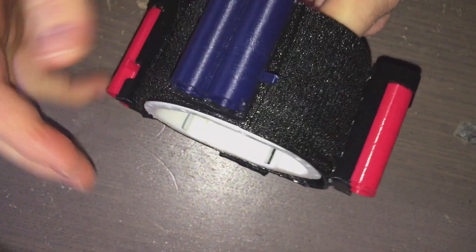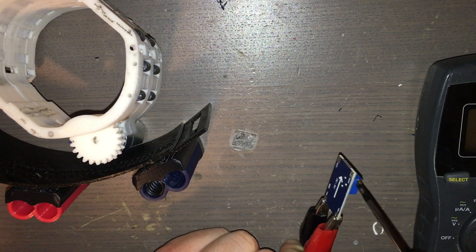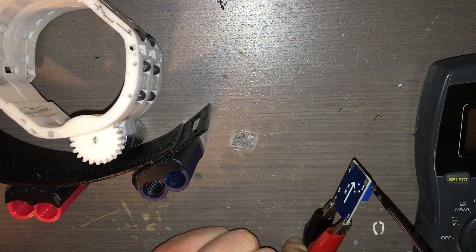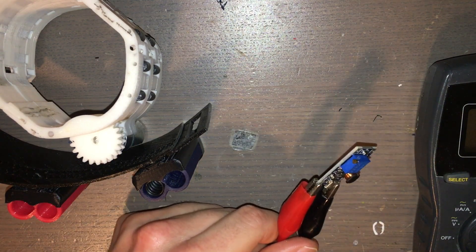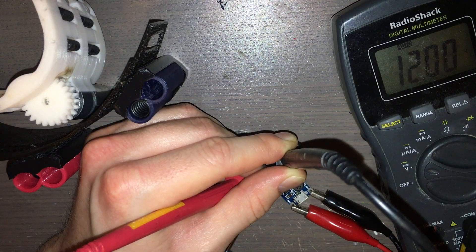I think the next step is to make a button for the palm so that I can rotate this with that button. For this project we're going to be using a voltage regulator because our power source is going to be five volts, but our motor requires 12 volts. This is an adjustable DC-DC converter. I just need to make sure I'm outputting 12 volts and then I can begin to assemble the circuit together. The reason why our power source is five volts is actually really cool — I'll talk about that later.